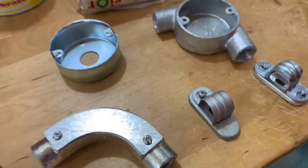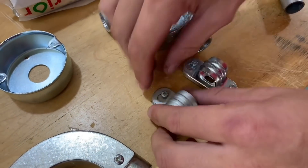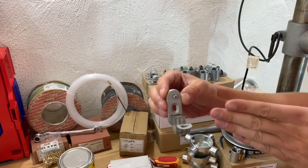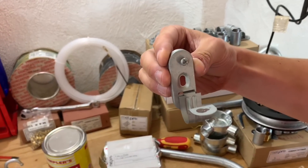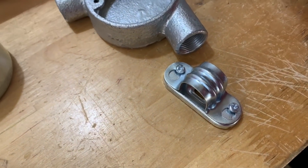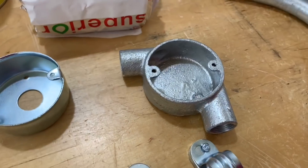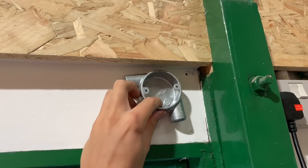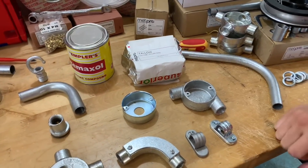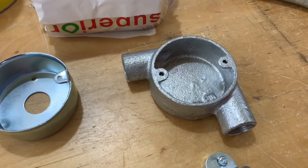We've looked at saddles in a previous video, so why this one? We've got a rapid saddle — a quick-fix alternative. You don't need to take the screw fully out; loosen it off and it drops on its hinge so you can sit your conduit in there as you're installing. Perfect for horizontal runs. It's got one screw to hold it on and one at the back, slightly different from a standard spacer bar saddle which has two screws and one at the back. We've also got a tangent angle box — using a tangent box, we can remain close to the ceiling, keeping the conduit in the corner of the ceiling or the walls.